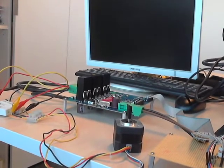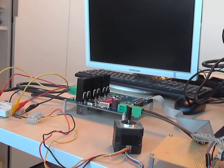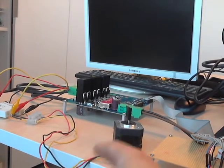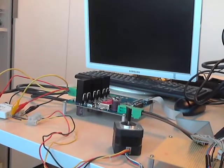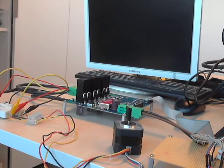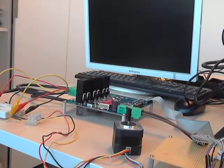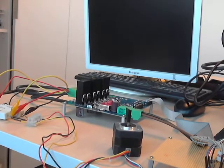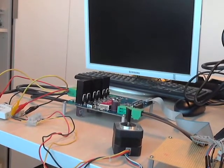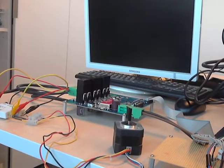By the way, the signaling for now is trapezoid. The signalings in these power cables which move the motor are trapezoid, which is the simplest method for driving the motor. Of course, it could be vector, which is going to be kind of sines, 3-phase sine for control, but that's much more complicated.